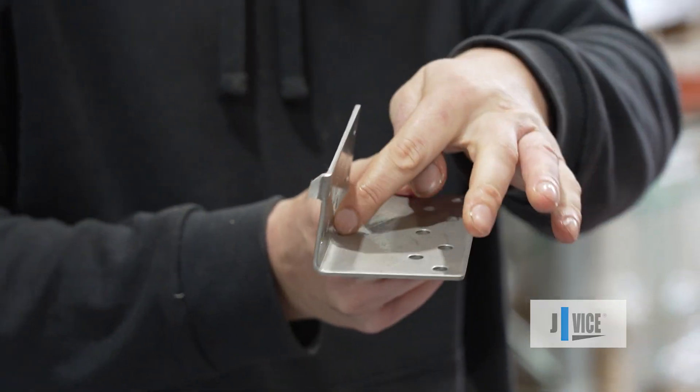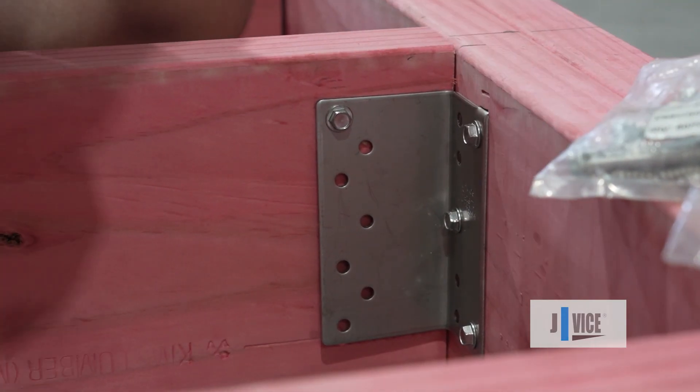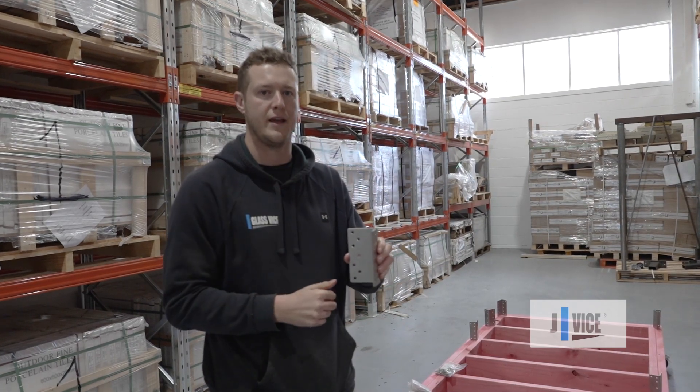We also have the 80-degree angle here. This means that when we screw the bracket off with tech screws, it's immediately under tension, bringing those boundary joists closer and stronger together — and that's what's going to give your balustrade more rigidity in the end.